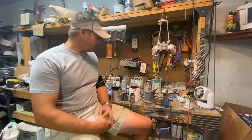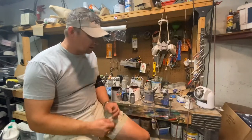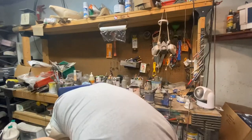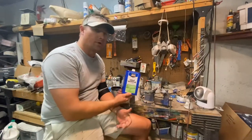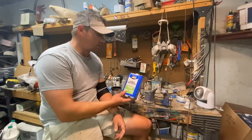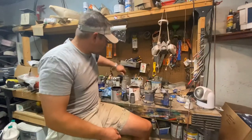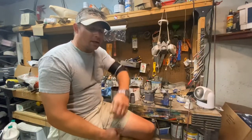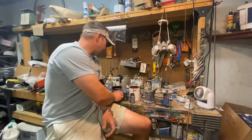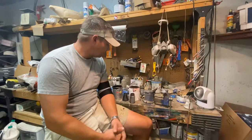So I'm going to show you the thinning ratio that I use, which is about 50-50. I use a product called Naphtha, available everywhere — Lowe's, Granger, whatever your local hardware store is, they probably have Naphtha. I keep it in a little squirt bottle, labeled up on top. I use these Rust-Oleum paints in a 50-50 mix with the Naphtha.